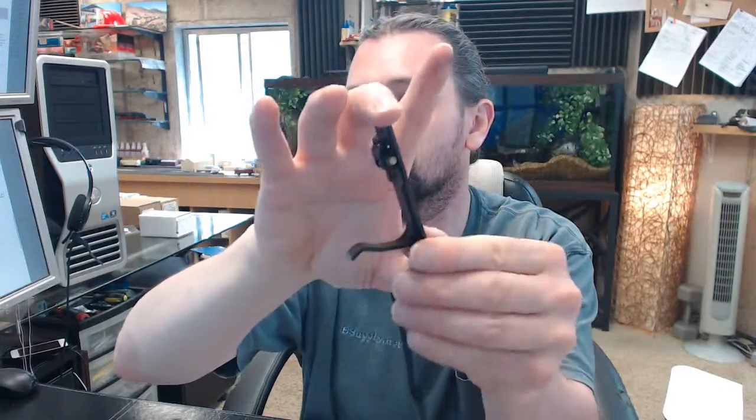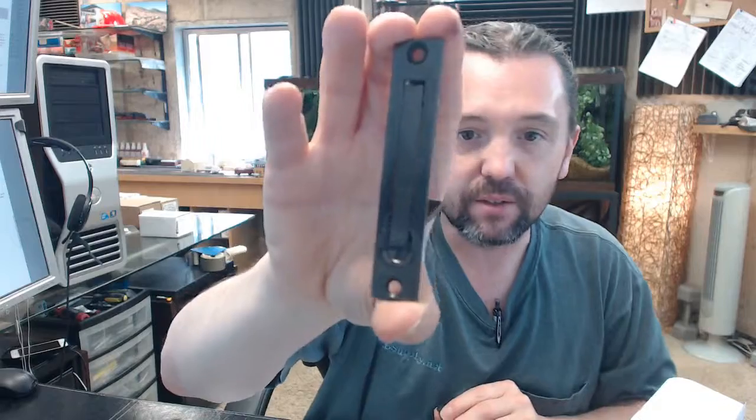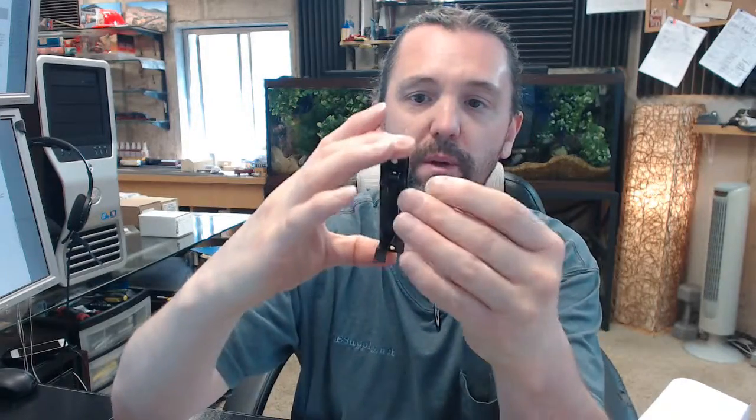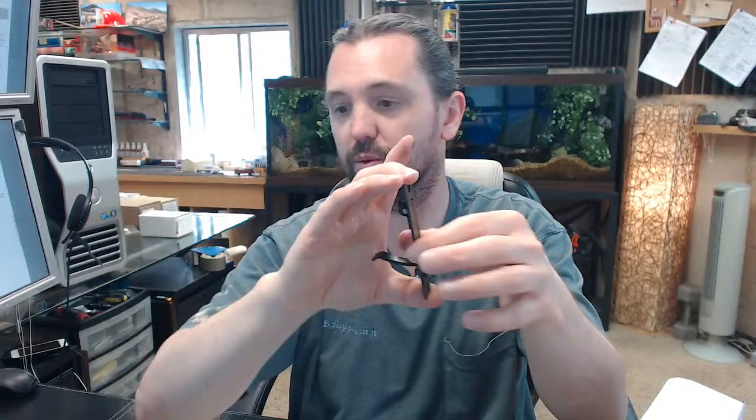The 613 indicates two things, actually. It means that it's oil rubbed bronze in the finish, but it also means that it's made of bronze. Okay? The only steel in there would be these flat springs behind here. How this works is pretty obvious. A finger depression here allows you to pull the door out of the pocket. Obviously, it's mounted to the edge of the door.